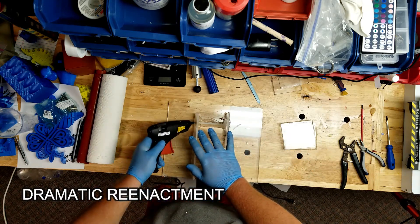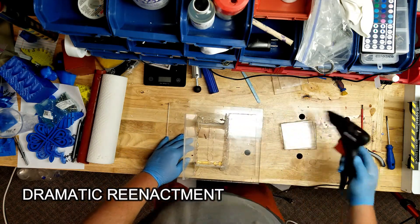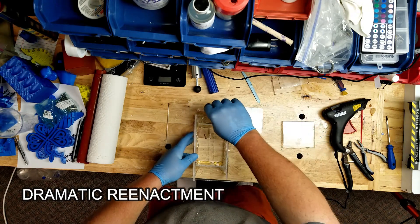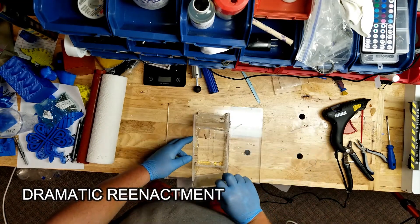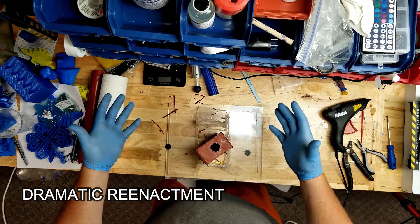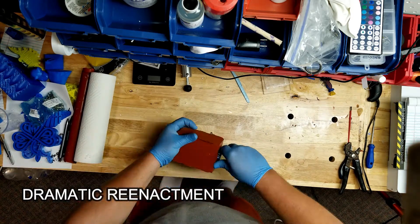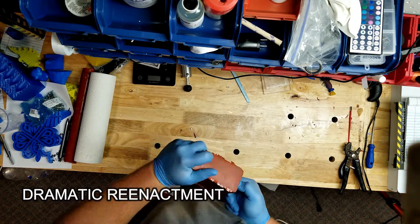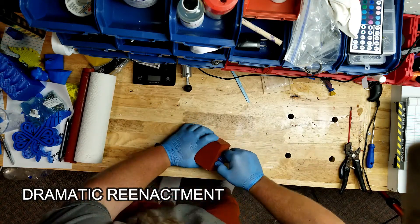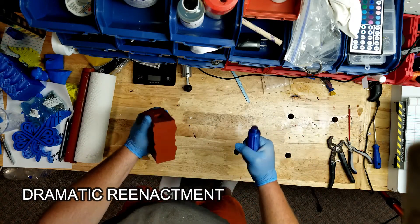I cast that in a one-part mold. Hindsight, I probably should have done it in a cylinder — like a small PVC tube, maybe like a two-inch schedule 40 PVC tube — that would have worked a whole lot better for the mold material and I would have saved a whole lot of mold material. But it is what it is. I made the mold box out of acrylic and just hot glued that all up together, poured that in, hot glued the base of the handle to the bottom, then poured in the Mold Max 60 and let that cure for about 20 hours or so. And then I could pour in the urethane for the handles.